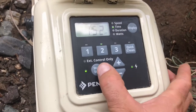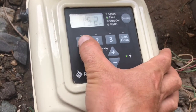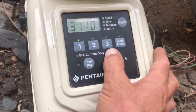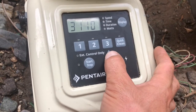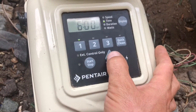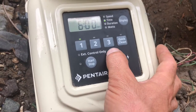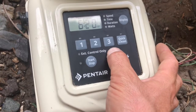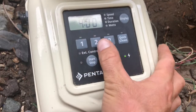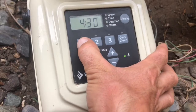If you're going to make permanent changes to the schedule, the pump button has to be off, then we can hit that number one button. That's going to put us in the speed setting. We adjust that speed up and down with the arrows. Once you've got it where you want it, hit that one button one more time — that brings you to the start time. This is where you select when you want that pump to go on during the day. Once that is set, hit that one button one more time and then you can set the duration — that is how long this pump is going to run. Four hours, five hours, six hours? This is where you decide. Once you have that set, hit that one button again.